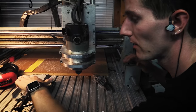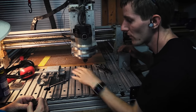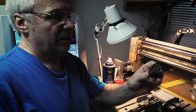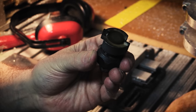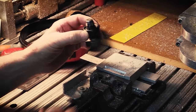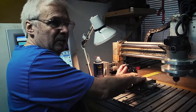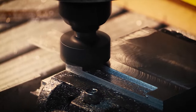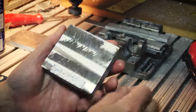We finished cutting out the little cutaway we need for the caps next to the socket, but we haven't actually finished the surface of the CPU block where it's going to make contact with the CPU. For that we need to change the bit — this little guy here is more for milling, with a cutting blade on each side. It takes about a thou off each pass, so it'll just clean this up and make it look like you got it in store. Good old fashioned sandpaper will smooth those out too.